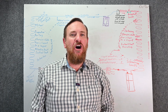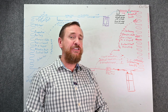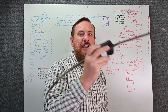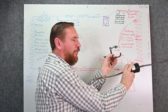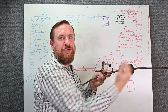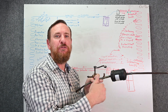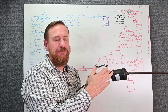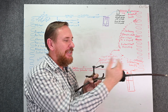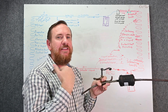There's a little bit more to it than that, so let's break down all of the components and go through the steps. Step number one: can we effectively do a pump down? Several things to consider. First, let's talk about where our service valve is going to be, and also our liquid line filter dryer. A lot of manufacturers install the liquid line filter dryer before the service valve. In that case, it's not going to be very good to do a pump down, because all the refrigerant would be stored over here on the high side. And any time we open the system for any reason, we're supposed to change the liquid line filter dryer — it's a disposable, replaceable part. If my liquid line filter dryer is before my service valve, I'm not going to be able to effectively do a pump down, because if I cut this out, I'm going to lose all the refrigerant. That's going to be an EPA violation and a hazard issue. So if the liquid line filter dryer is before this valve, that's going to be a no-go.